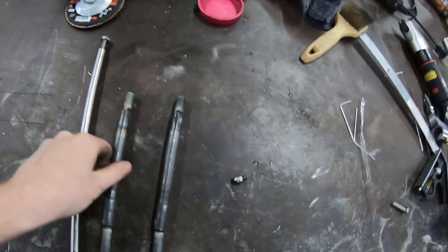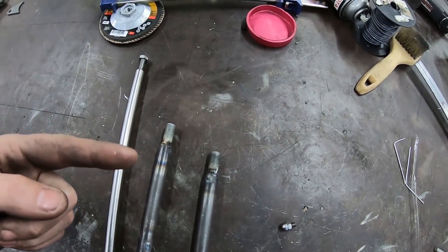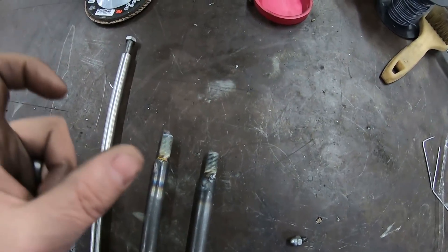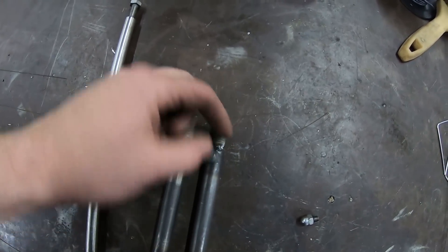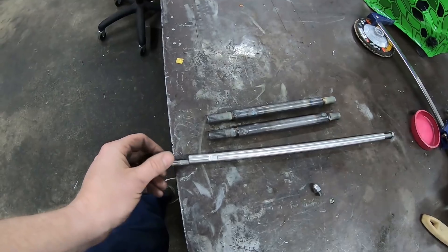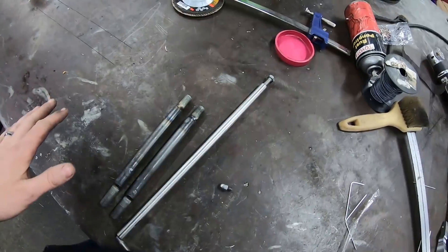After I got the box in and was looking at putting the strap in, I ran into an issue I didn't foresee. Having studs on top means that to slide the strap straight through the side of the box, I'd need a slot big enough for it to slide over the stud and down - which would leave pretty big holes in the side. So I need a female insert instead - the bolt goes in rather than a stud sticking out. I have some quarter-inch steel hardware pieces that are tapped on both ends and weldable. I'll cut off just the one ends, slide them in, and weld them in at the same height. Big issue, simple fix.